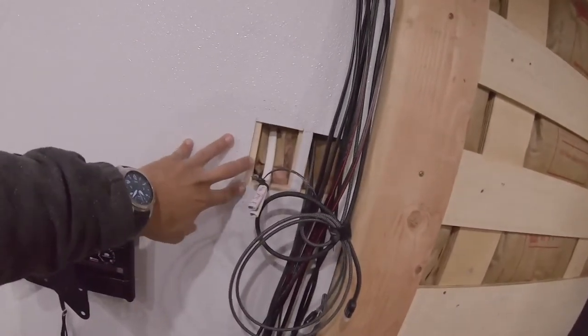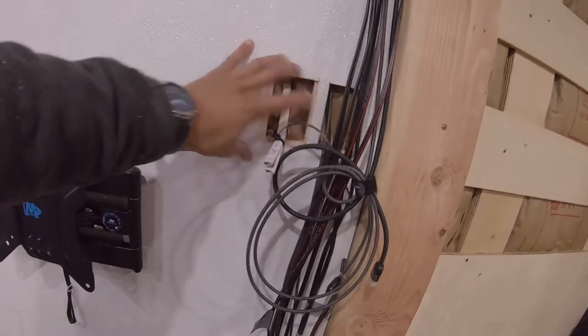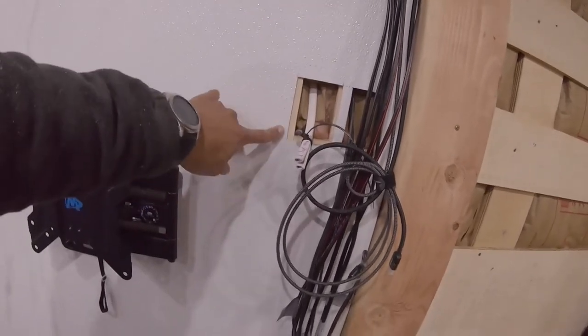Voila. They tell you to use a 5/32 drill bit for the lag bolts, and not to use a drill to drive them. You want to slowly screw those in, you don't want to strip that out. So that's per the instructions. But the wall came out pretty good. All these that you see here, the light sockets will actually cover, so you won't see any wood, and the wall cleans up pretty easy, so that's not an issue.